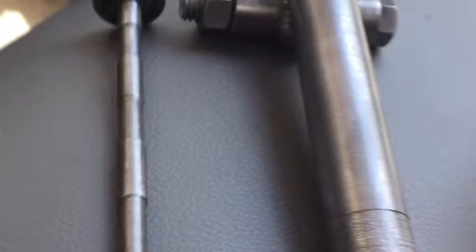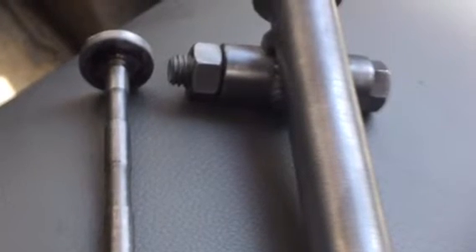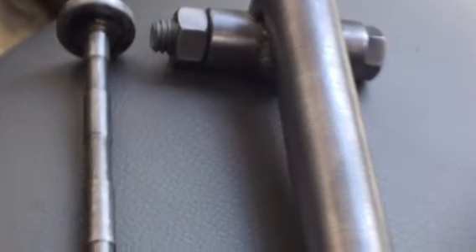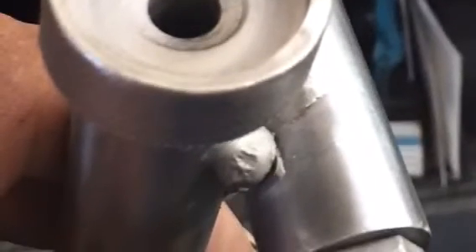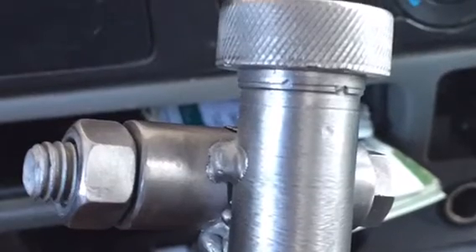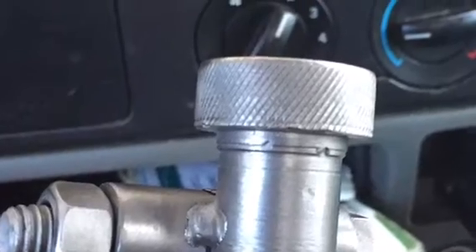Here are the two pieces. On the right is the body, left is the stem with the dial on top. Across there is a mounting piece that has a 7/16 bolt that will screw into the side of the carriage. I took the body bolt, rounded off the head, drilled all the way through it, dished it out to accommodate the dial, and then did some fancy stuff. I did a little narrowing on it — it's crude, but I think it'll work. All I need to do is know when to engage the half nuts, not to launch a satellite.